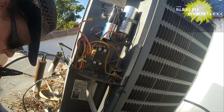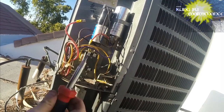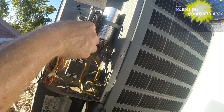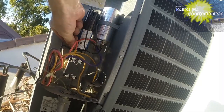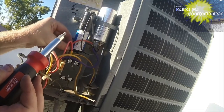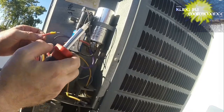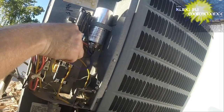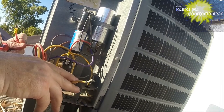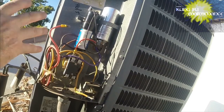So that one can go right here. Now I've got to re-tighten that post, because this particular contactor actually holds that contact in place. I made that nice and tight. This has a couple ports, I can get one here. Ideally I would have put the forked portion on this side so I can get under there easier if I ever need to remove it again in the future. We need that connection to the common so that we can power the fan. Now the start wire for the compressor and the run wire for the compressor both are disconnected, so all that's left connected is the common.